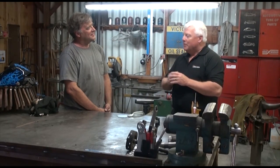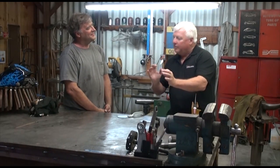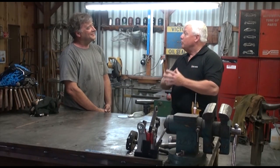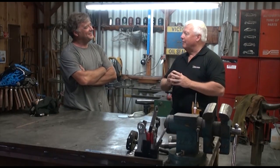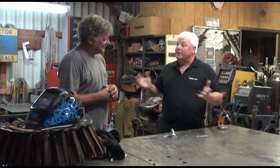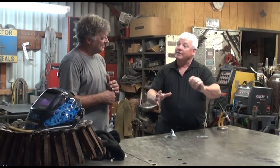When somebody takes that MIG mix bottle and puts it on their TIG machine, they find out right away. Here's the description I get: a guy or gal calls me and says, 'I just set up my new welding machine — love the machine, got the torch and plates, the tungsten set just right, the gas lens, everything you said.' When they light an arc on steel, it starts a puddle and then it flares out. Immediately I ask them if they're using their MIG mix — that 75-25 — and I can tell you, this happens every day. In the TIG process, you can use argon for everything. It's a completely inert gas. The gas also transfers the arc, so you need a nice flooding of argon to get the arc initiation correct.